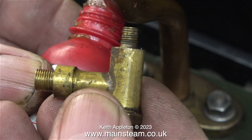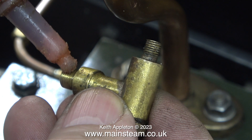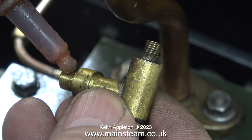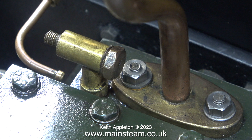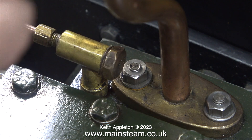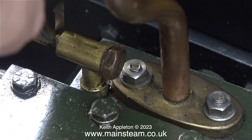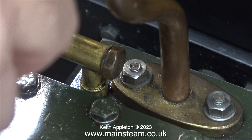Now it's time to refit the check valve for the oil feed to the steam chest, and for this, as always, I'm using some Loctite 542 thread sealant - not too much, just enough to fill the threads on this side. This fitting screwed into place fully by hand; I didn't have to use a spanner or any sort of tool to tighten it. My vice-like grip and large fingers were perfect to get it into the right position. Here I'm refitting the union nut, and once again this had been over-tightened so it had to be spanned into position every step of the way.